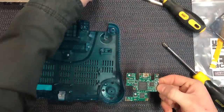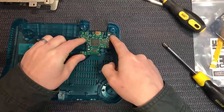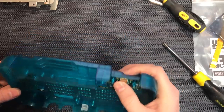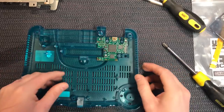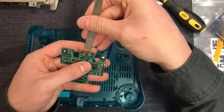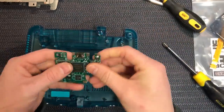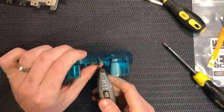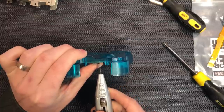So let's get on with this and do a test fit of the board and do our physical cutting and mods to the case. Just open the packet up. It's going to sit about there, so we need to cut the back plastic. I'll just mark that and start my cuts and file it down really carefully. The connector matches my file — it's just a bit smaller, which is perfect. So the way to do this is to just sit the board in, settle on the position, and just mark the edges very carefully with just the blade so you know where to start and stop the cut.